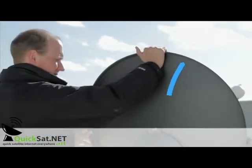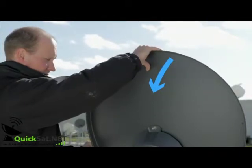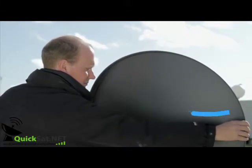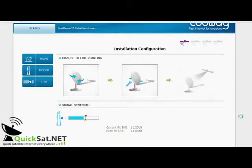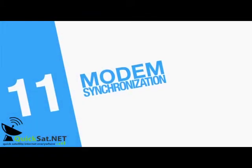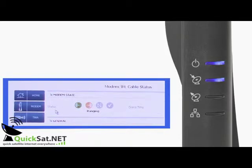To test the pointing, gently push and pull on the top of the antenna and see if it returns to a continuous tone. Then push and pull on the sides of the antenna — it should return to the continuous tone if it is pointed correctly. Once the pointing test is finished, you'll see a third box with a tick. Click the arrow on the right-hand side. The first stage is receive synchronization with the network. The modem then ranges and synchronizes its transmission and enters the network. It then receives DHCP and network information. Finally, when the LAN LED is blinking, it is on the last stage of synchronization.